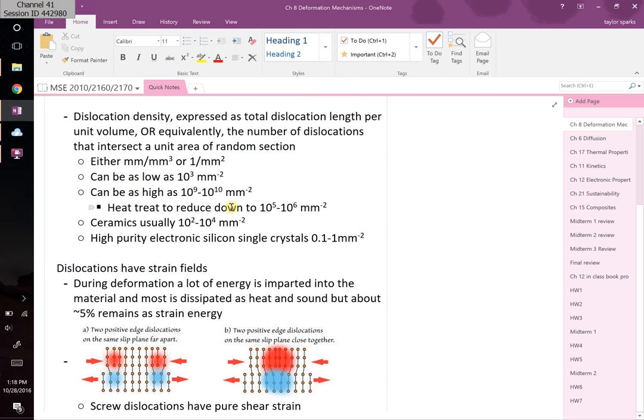It gives them thermal energy. Imagine you guys wanted to arrange yourselves in this row in some different way, but I froze you solid, you can't do it. If I then add some energy and allow you to move around, then you can stand up and sit right there. Dislocations can move, and it's the exact same way. They need thermal energy. Hence why the blacksmith keeps on putting it back in the fire to get it glowing orange or even hotter, and then he takes it out and deforms it because there's more thermal energy for things to move around easier. And when it cools down, if you keep hitting it, then those dislocations can't move, and instead of getting deformation, you might get fracture. In fact, you will get fracture.